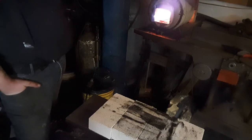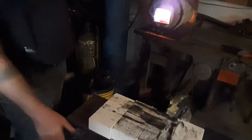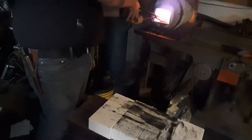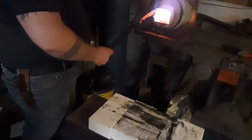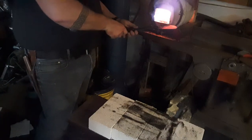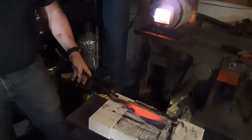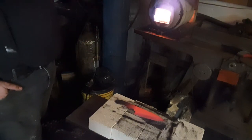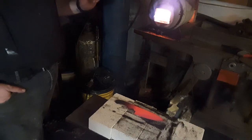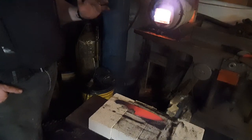It's not going to be non-magnetic when we pull it out this time. It's probably getting close now anyway. Very nice — so that's it, the third one. I'm going to let this cool. I can't heat my forge up to 3000 degrees because I have my pressure on my regulator turned so low that I know it's not going to get hot enough to scorch my steel.